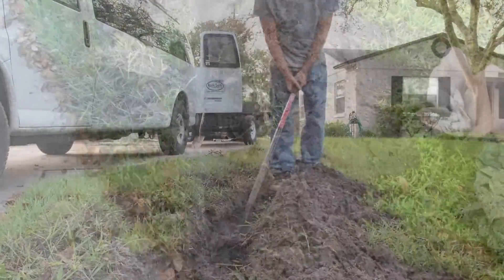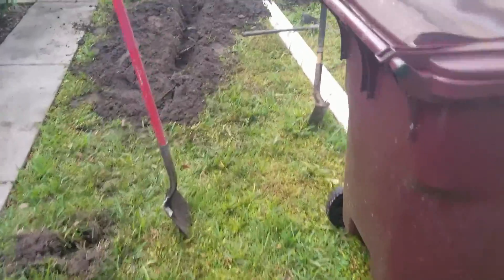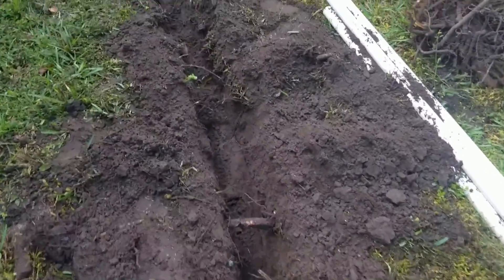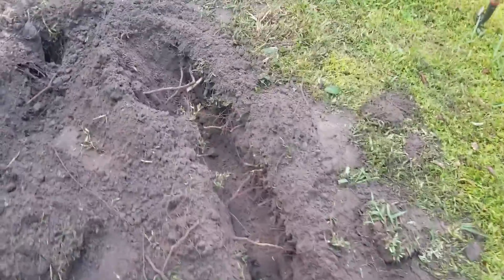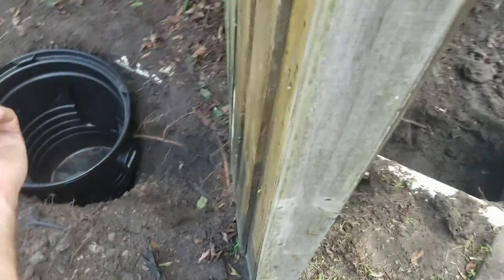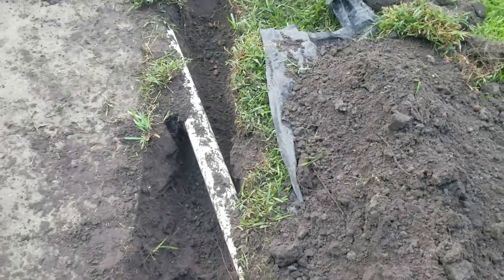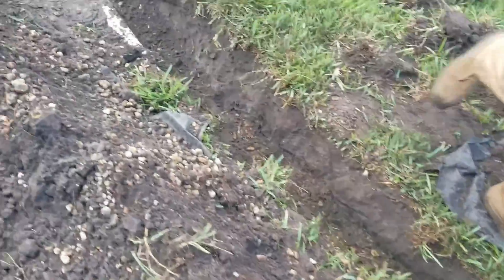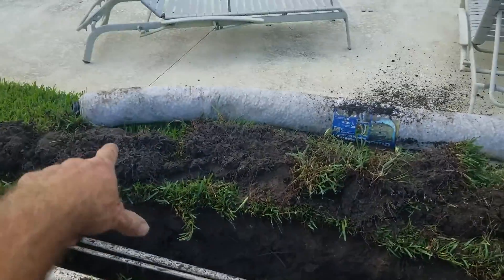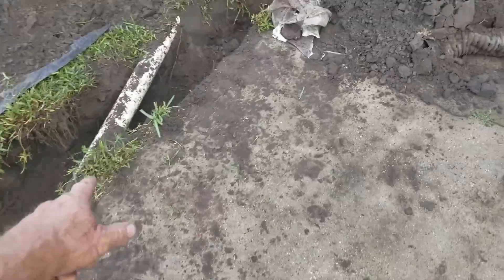In just a minute, you can see I've already trenched 10 feet. Let's go back and see what else they're finding underground. This job is really almost done — we're going to set the pump up in a second. Nice little trench — just wide enough and deep enough to put that inch-and-a-half pipe. We're going to tunnel underneath this sidewalk over to the sump pit; that's the discharge. Our inlet line is here, and Joe's made quick work of this. He's already got this ready to lay pipe. We're going to start our French drain, which is the Easy Flow styrofoam peanut pipe, with a couple of catch basins along the route.